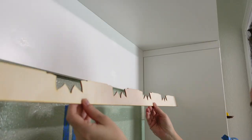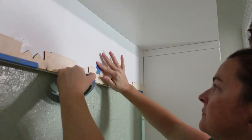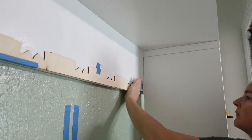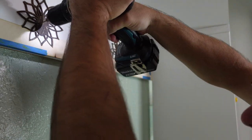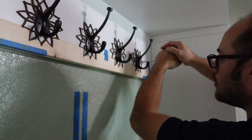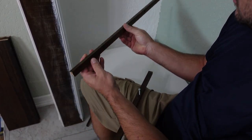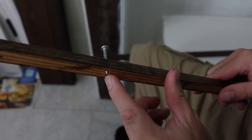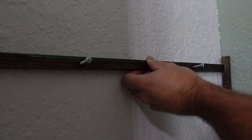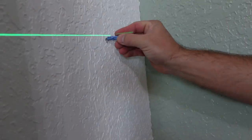With all the stained pieces drying, it was time to sand the spackling and then paint to hide the mounting holes. In order to place the hooks and mandalas right where we wanted them, we made a template on the laser that perfectly spaces and holds them level with one another. We just had to tape it flush with the bottom of the board that was already leveled earlier when we mounted it to the studs. Wendy attached the mandalas to the board with a little bit of super glue to hold them in place, so I could then come through and pre-drill all the screw holes for mounting the hooks. With all the holes drilled, it was time to drive the screws in and mount all the hooks. Wendy removed the template, and the project was really starting to come together. We pre-drilled the rails for the side shelves, counter-bored them so the screw heads would be below the surface, then pressed them against the wall to mark anchor positions before attaching them.